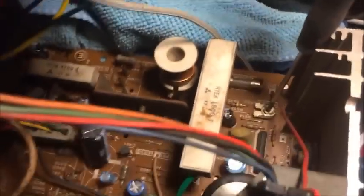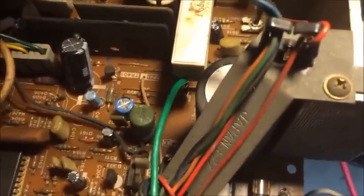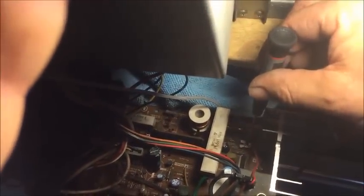So we want to see how to adjust the B positive. There is that ceramic resistor with the BJ terminal going to the B positive, and I have my screwdriver in there to adjust it. We check the B positive, put the meter on there like that — it's at 107. Need a little bit more... 107.3. That's pretty damn good, real close to 108.